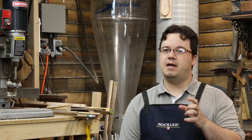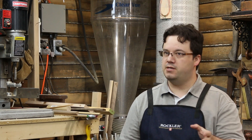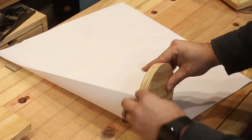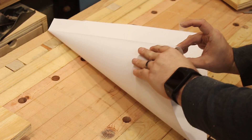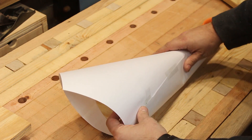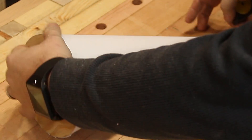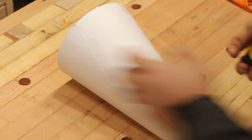The cone was definitely the most difficult part. I knew I wanted the upper diameter to fit the barrel, and I knew I wanted the angle of the side to be 11 degrees because that's the most efficient taper. So I cut out a disc with an 11-degree bevel all the way around the edge and then wrapped paper around it to form a cone. It took a little bit of fussing — the cone kept coming out lopsided, but I got it eventually.